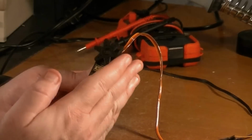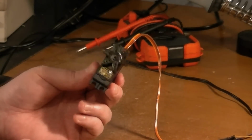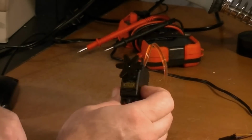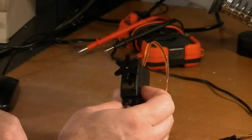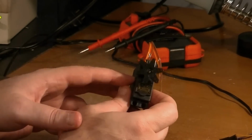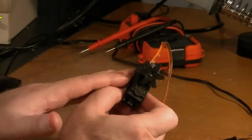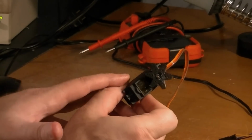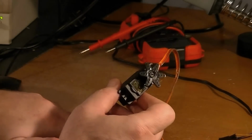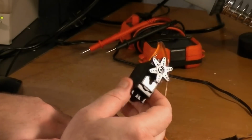And anywhere in between, you can make your servo go different speeds. If you're using this to drive a robot, then you're also going to have to calibrate your two servos at full speed. Like if you want to go full speed, one of them might run on 180 and the other servo might be a little too fast, so you might have to run it at 177 for straight travel. But that's just the nature of an analog device like a motor.